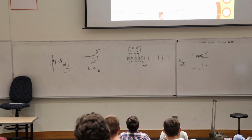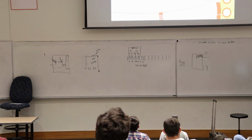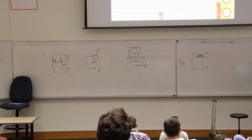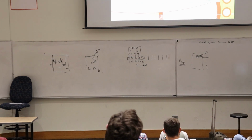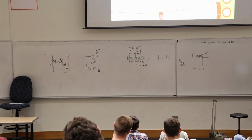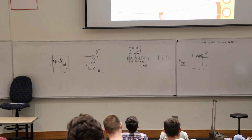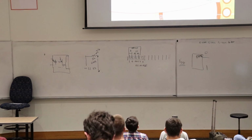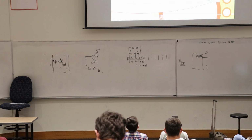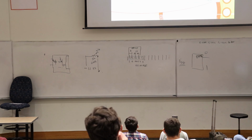And that's true for the input low voltage and the input high voltage. So the line we need to look at is TTL, and it takes these two lines. And notice, if we're running at a VDD between 4.5 volts and 5.5 volts, then we define a 0 as anything 0.8 and lower. If we're running between 1.8 volts and 4.5 volts, such as 3.3 volts, now what we define as a 0 is anything equal to or less than 0.15 VDD.